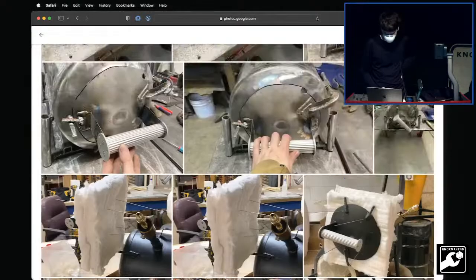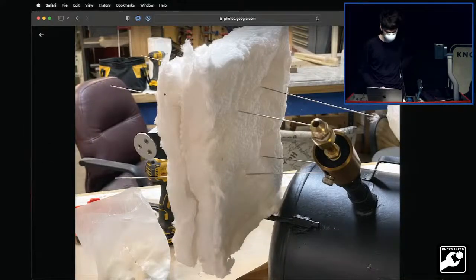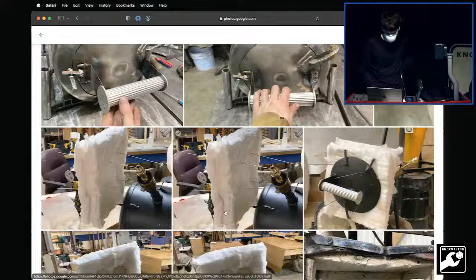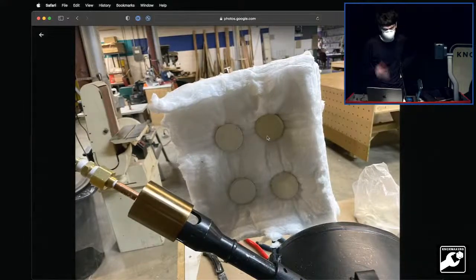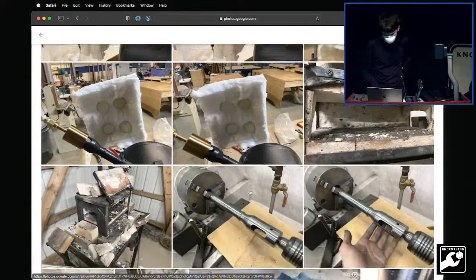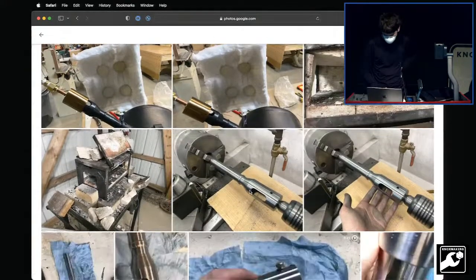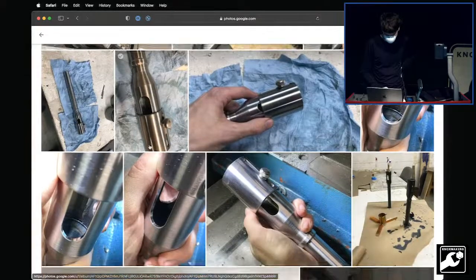The insulation is held on, which is ceramic fiber insulation. That's the only thing that really takes up the temperature well. And we take stainless steel welding wire, and it goes through these little buttons, so it's mechanically holding it on there. And the buttons deflect away most of the heat, and then the stainless on the other side of it is low enough in temperature that the stainless can take it. That's how it works.